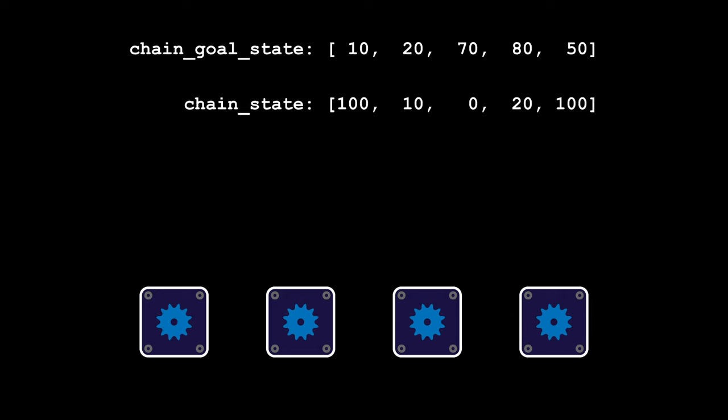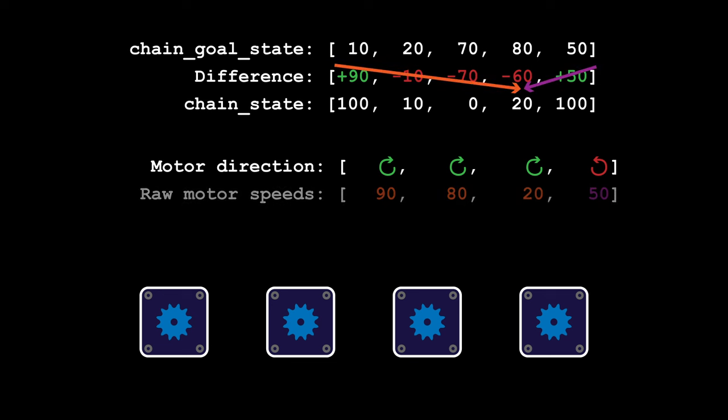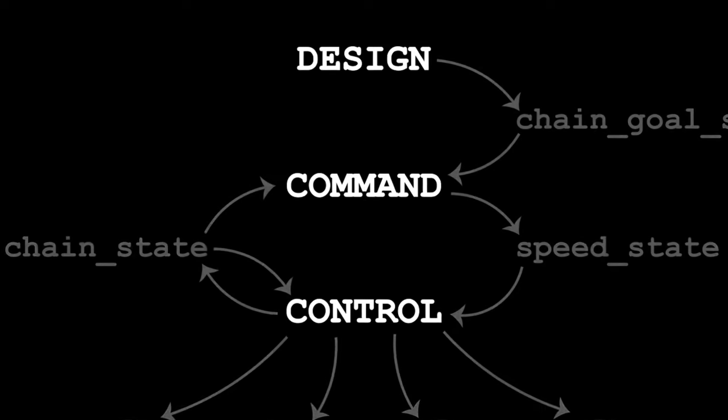Whoops. I ended up with a hackier but more flexible approach of first determining what direction each motor was turning by looking at what needed chain and what needed to get rid of chain. Then the scaling of motor speed was worked out by stepping through each watershed and seeing how much was coming from each source and how much was going to each destination. These speeds were then normalized across all the motors and scaled down by the current speed factor. There were still some edge cases it had troubles with, but the system was robust enough to fail gracefully.